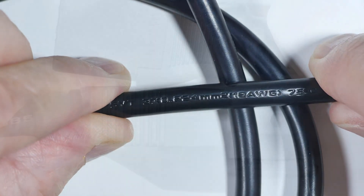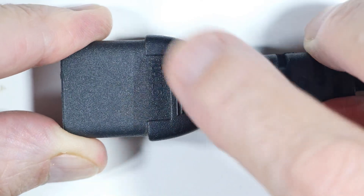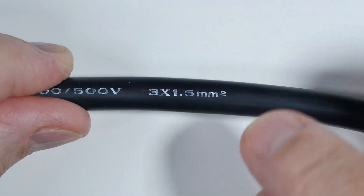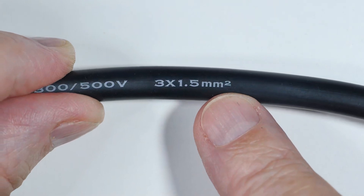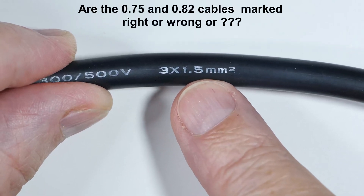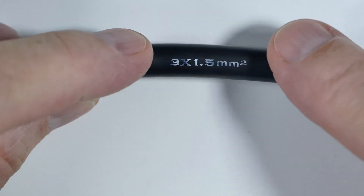Personally I'm going to go another size up. This next option says 10 amps at 250 volts — 250 volts is good and having a little spare headroom is good. Going around the cord, it is three conductors of 1.5mm² squared. It's a little scary that a larger wire is still only claiming 10 amps, but I'd believe that this 1.5mm² cable is more genuinely capable of 10 amps than the smaller ones.